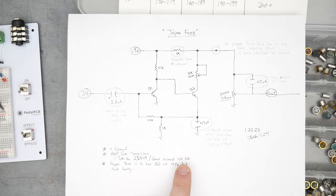So as Josh Scott mentioned in their video, you want to be careful not to touch germaniums while you're testing them because you can throw off the gain measurement. I just want to see. Maybe I do have some Japanese ones in here. This is a Matsushita 2SB173. There you go. Matsushita 2SB173. Matsushita was one of the big Japanese manufacturers of semiconductors. They became Panasonic, the same Panasonic we know today. We'll throw this in the tester, see what happens.